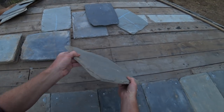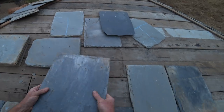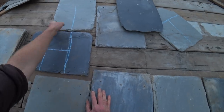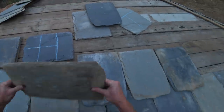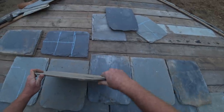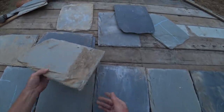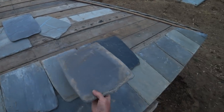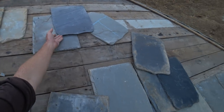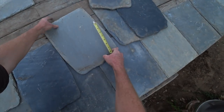We're ready to start throwing down the first row of patterned slates. I'm gonna do the same thing of sorting thick to thin. A lot of these are pretty thick which is fine. I can see some are going to be rejects - look at how wobbly this is already. Some of these are probably leftover from other sides of the roof. This one has a huge curve, same with this one - I'm gonna have to grind all this down with the diamond grinder.